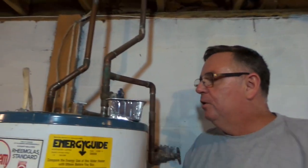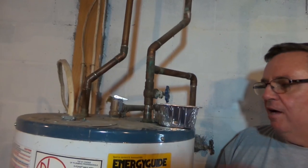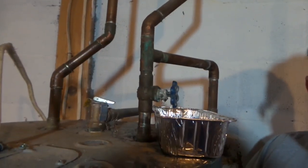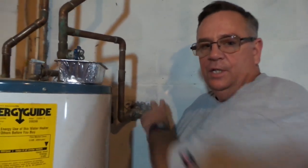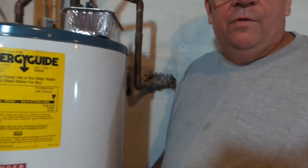Today we are going to be repairing a leak in our hot water heater cold water supply line shutoff valve. In preparation for this task, we've hit the breaker to turn off the power to the hot water heater, shut off the cold water supply line to the house, and turned on all our faucets to get the water out of the lines.